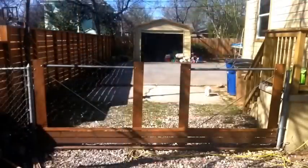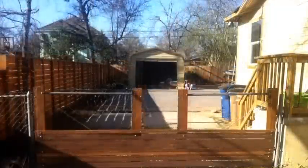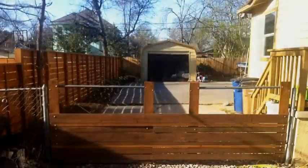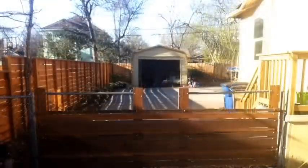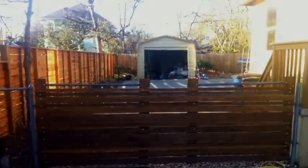One of the major things is trying to keep your fence level as you add the boards on. You can use a paint stick in between or a measuring tape from the bottom each time — I recommend both, but the measuring tape will definitely keep it level. Also decide if you want to cut your board ahead of time on the table saw where the gate is going to open; it gave me a lot of trouble not doing that.